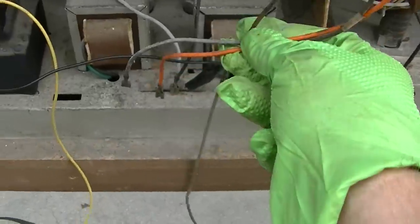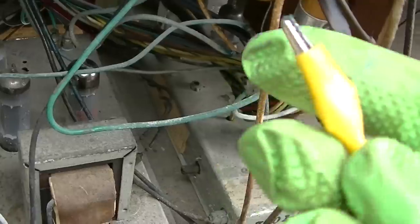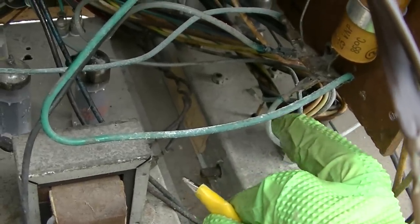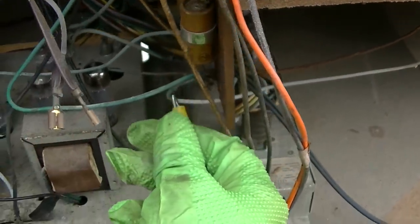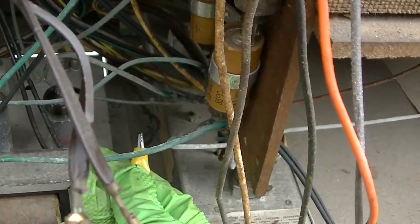Okay, what's going on here? Well, these are the wires that were connected to the amp. Those are going up to the speaker switch. The wires coming down from the speaker switch are these two. And so they go to two sides of the crossover. One lead goes directly to the woofer, and then the other goes through the capacitor and then the resistor to the horn tweeter. So what's interesting is something's wrong here, because that is making noise, and I'm using a current limiting light bulb. That's making noise through both speakers. What the... I don't get it.